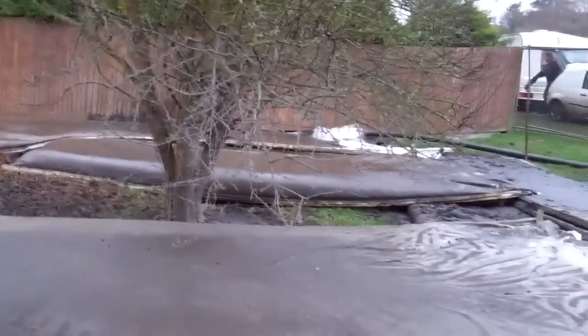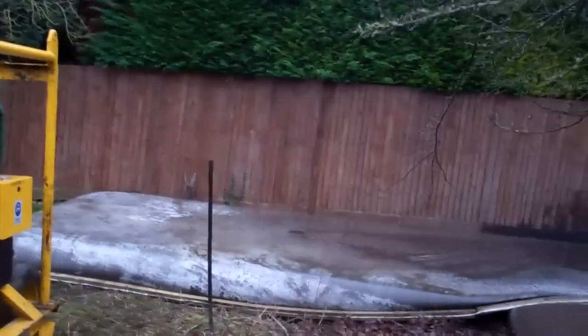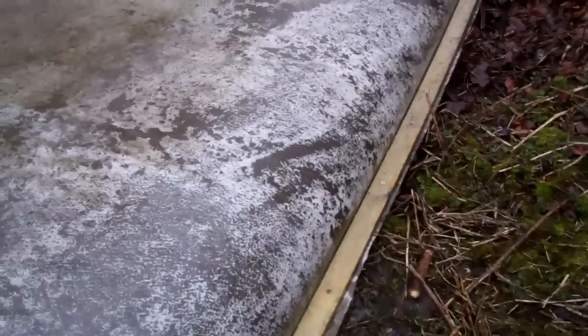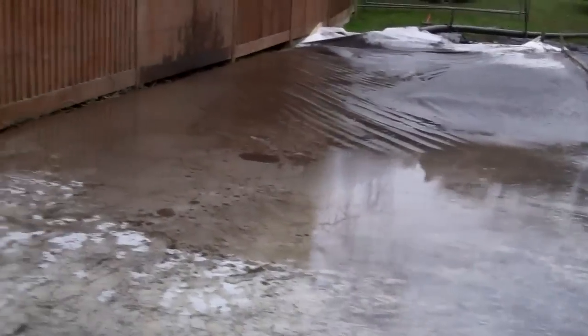Just walking across them here. They're not contained in the material. What we do is pump into one and let it drain down. As you can see, the water is coming out the top of it here, lovely and clean. That one we used — filled that one up last night — and the water is running out there. So it's dewatering itself. There's quite a bit of water coming out of there. That will keep dewatering and it will eventually be completely dry material in there.